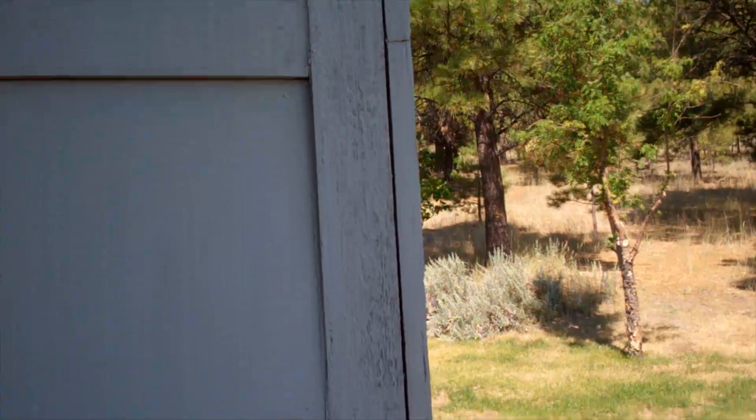Okay, let's go outside. You're going to want to caulk anywhere the corner boards meet the siding. See that crack in there? You can follow it all the way down in there. It got wider where I dug the old caulk out. Now here's a good example of some corner board that could use some caulking, just look a lot better. Get down there, it's probably never caulked. I mean, when you're trying to sell a house or something, that stuff just looks ugly.